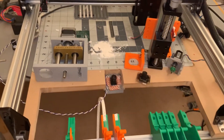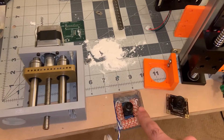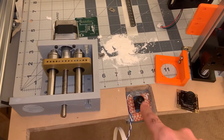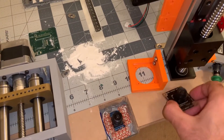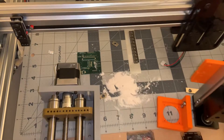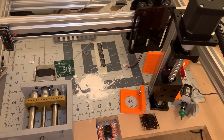The whole system basically has two cameras — one for the bottom, and there's another one that can see from the top. The top camera moves with the Z-axis, detects small parts, and also if you have fiducials on your PCB, this particular camera should catch all of those things.